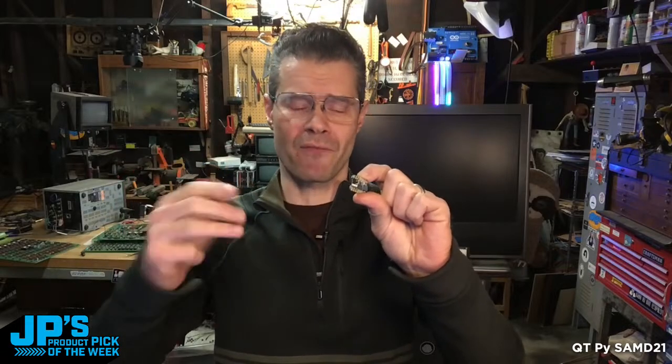And the Cortex M0 is fantastic. We have so many projects that you can build. If you look in the Learn guides, you'll see there's a ton of stuff you can do with the SAMD21 M0 based projects. Some of the things I love about it: one, USB-C. Two, the fact that it is USB HID compliant all the way through, so you can do MIDI projects, keyboard projects, mouse projects, serial stuff, all available over USB. So it makes it great for those types of projects. Also, because of the Stemma QT port on there, you can plug in the many I2C peripherals that are available out there, especially the ones that have that Stemma QT port. It makes it plug and play.